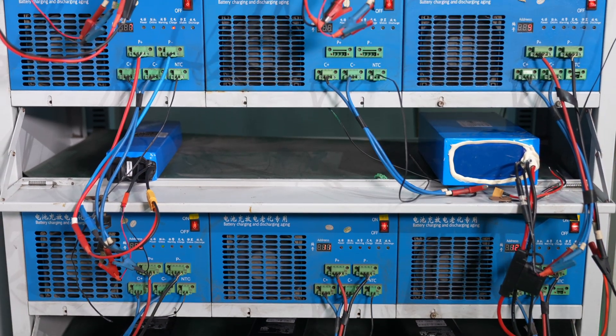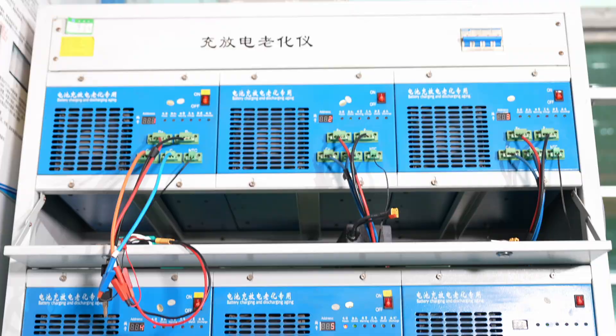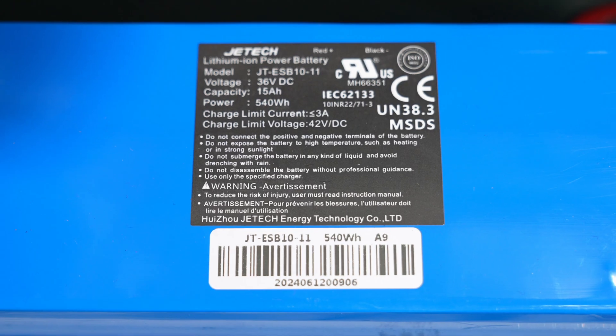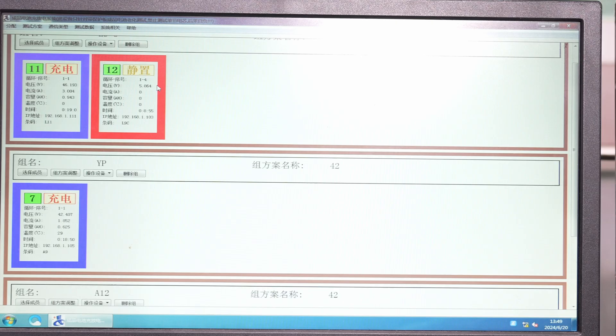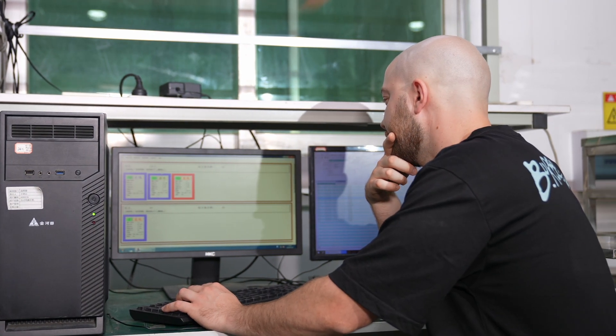This is what you see happening here with a battery. We're gonna select some batteries of our different models, put them in this rig, and this rig is gonna be able to tell us the total capacity of the battery. It's gonna be able to charge it completely and discharge it completely, and it's gonna monitor the temperature as well.